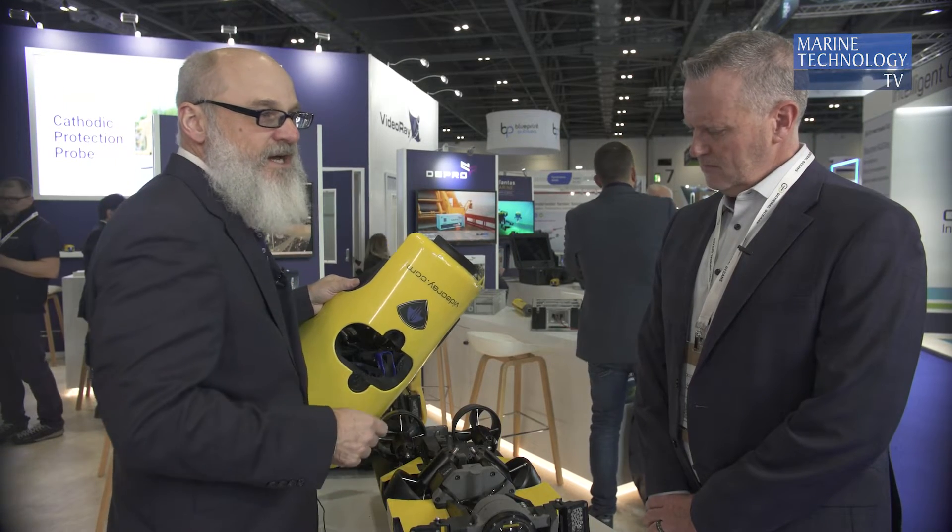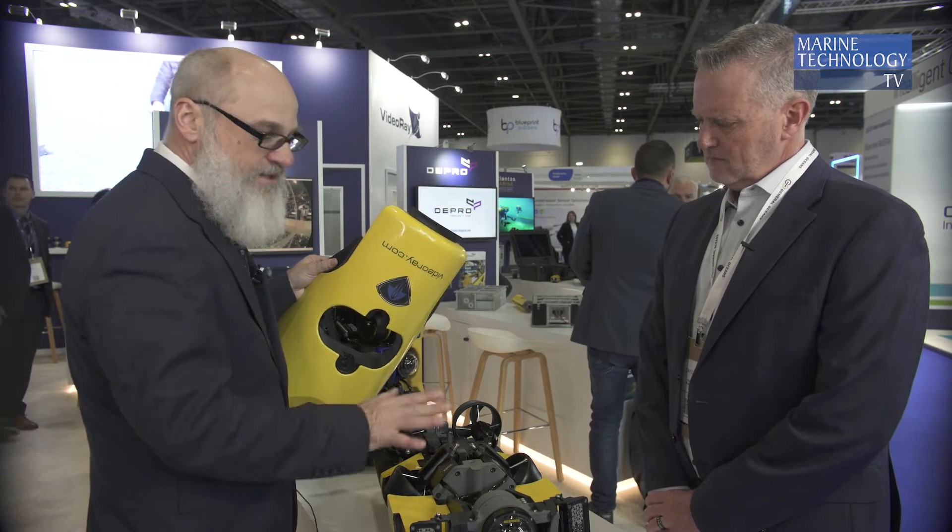You pop the float off and put on our square float — everything's tucked in and arranged neatly. All thrusters are identical. This is our power module at one and a half kilowatts. There's a comms module that gives us 100-megabit Ethernet, 12-volt, 24-volt, and RS-485 digital data bus, with five ports — so lots of room for expandability.